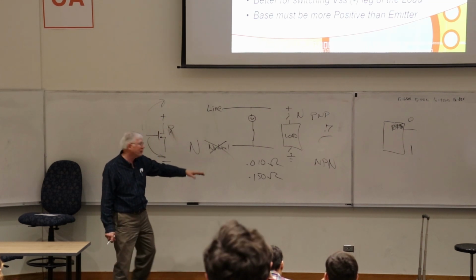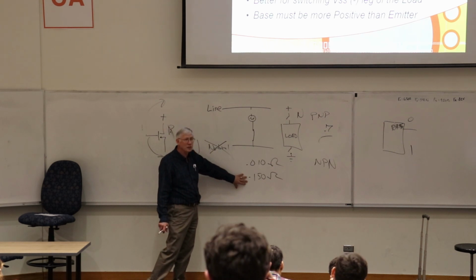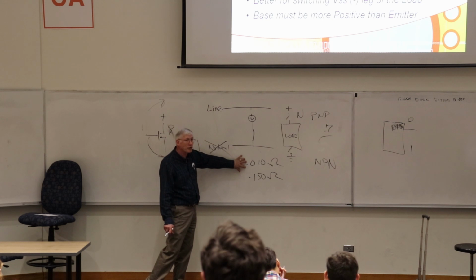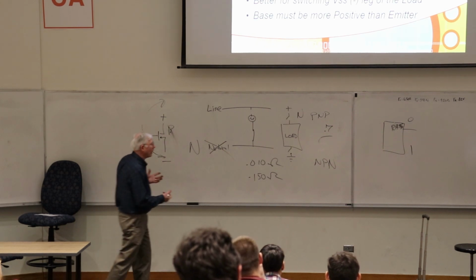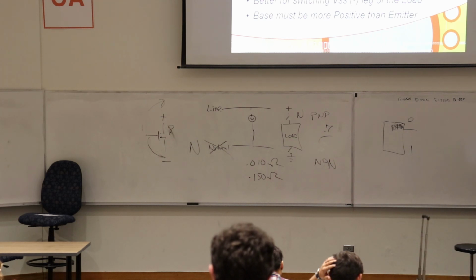And for high-powered devices, that's heat. That's voltage drop and heat. So you can't take too much of this in a high-powered device. It's going to cost you. Whereas here, much less heat, much more power can go through. So that's really what drives that. Oftentimes with H-bridges, we play these games. We have built-in charge pump devices to use N-channel FETs in both the high side and the low side.